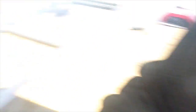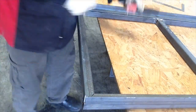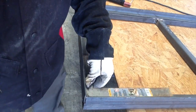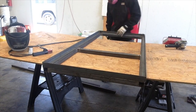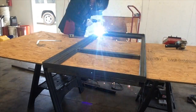When you're fabricating like this, trying to get everything perfect and get it all clamped down sometimes just isn't as good as getting a little bit at a time — one tack here and there — then working your way around. At least that's been my experience. If I had the strong hand table set up, I could set it all up with stops and lock it all down. But I don't — I'm making do today, and this is what a lot of people have to do.